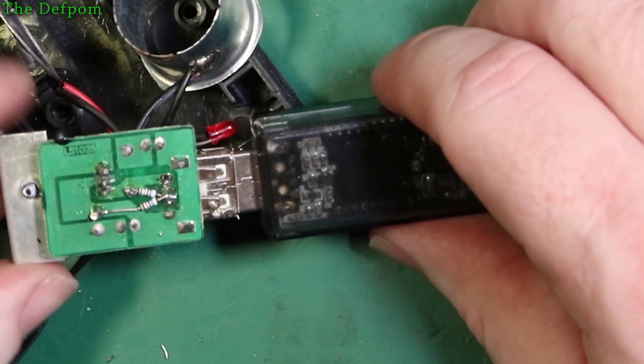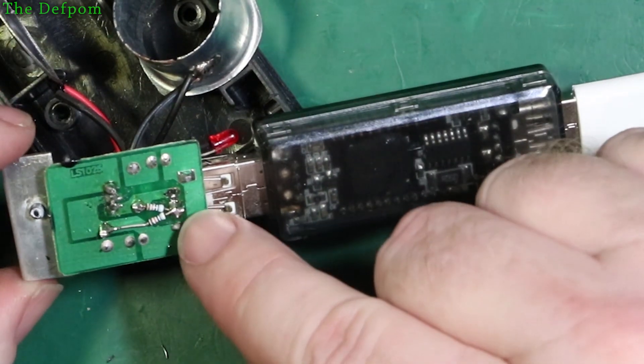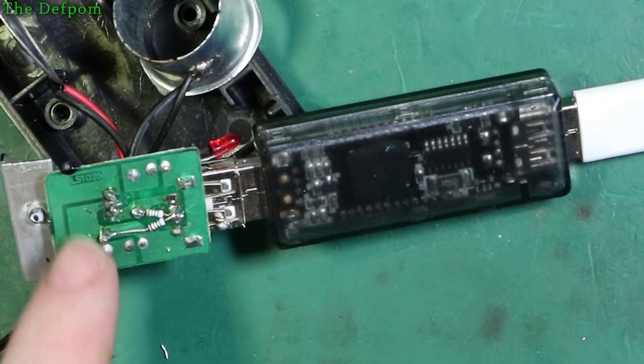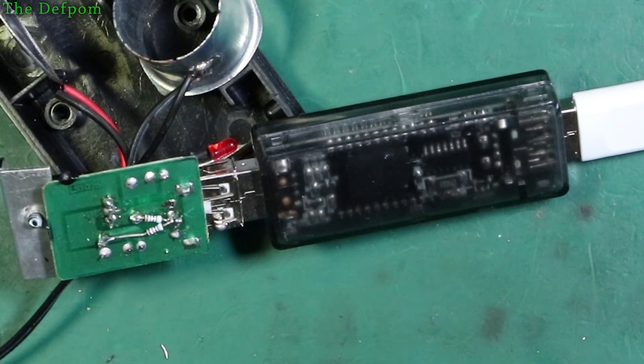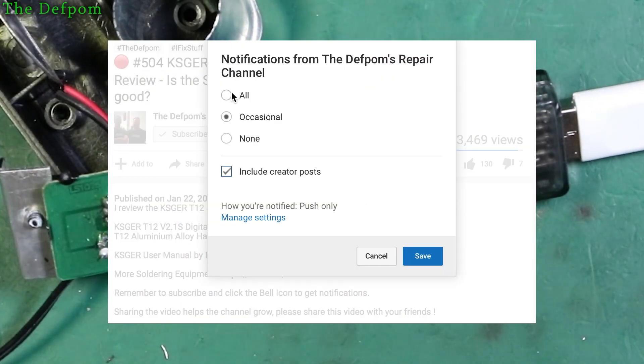So that's what does it. I don't know about the charging currents on that - that may be drawing too much current. But that's it. So: one mega-ohm resistors between positive and negative, and linking the D+ and D- data pins together. There you go. Hope you found it interesting. Catch you later, don't forget to subscribe. Bye.